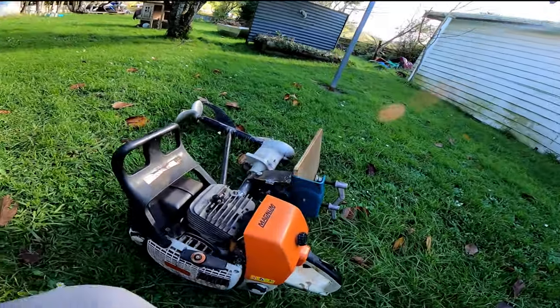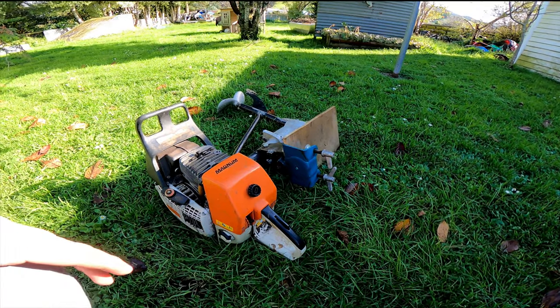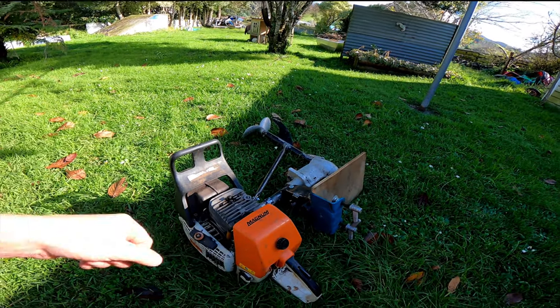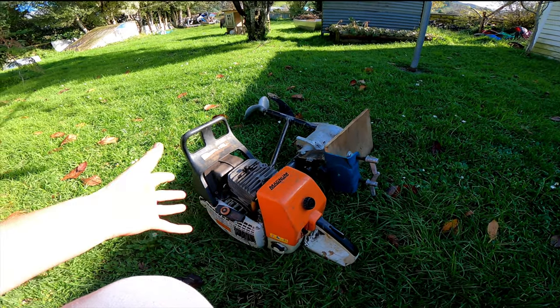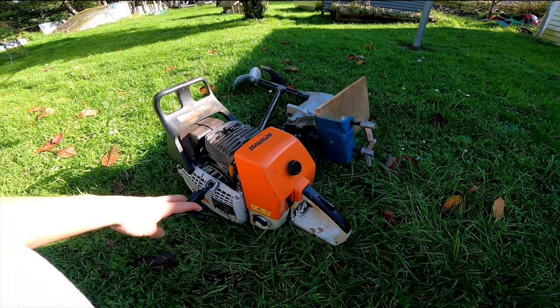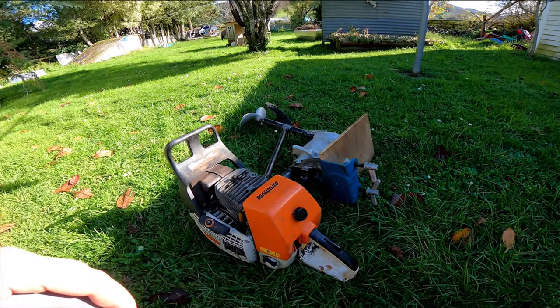Well that was pretty hard out — the river was just so crazy I didn't want to test too much more, I was going to get swept down in the big current. But it started to work at the end. What I need to change is to make the handle longer so I can sit further forward and get more balance and leverage to lift the prop out of the water. I think I can also go to the more aggressive prop if I feed it into the water slowly. It seems to stall really easy — I don't know if chainsaw motors are designed to stall when they jam on a log. I might need to put a bigger flywheel on it. Also starting it — I can't really start it in the water, so maybe I need to extend the pull cord and make a pulley. Expansion chamber going into the water would make it quieter and more powerful. Thanks for watching guys and see you next time.